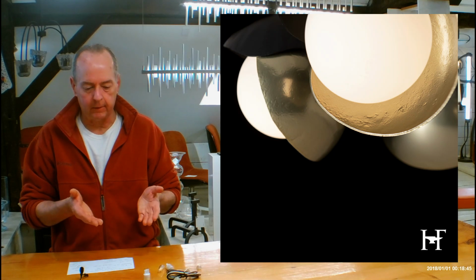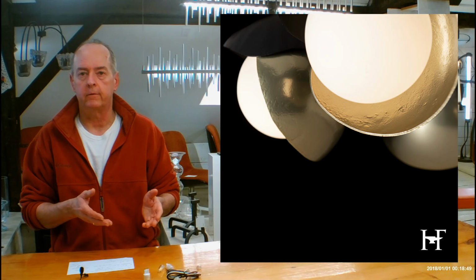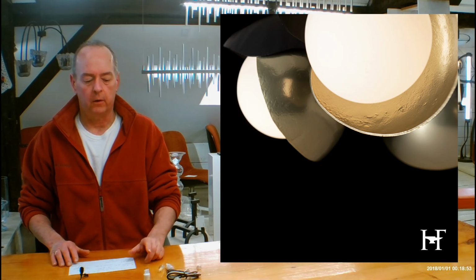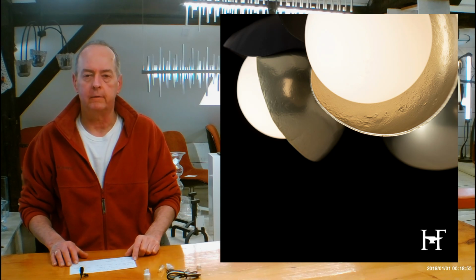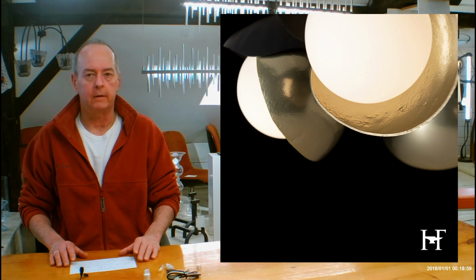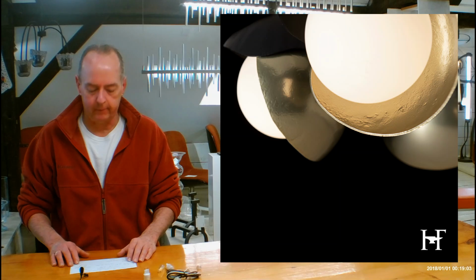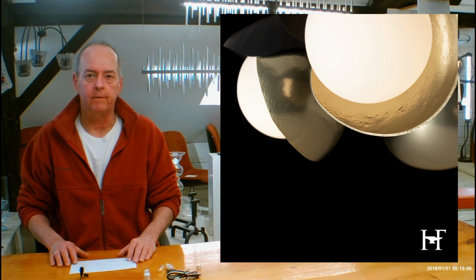The color of the light that they offer these to you is always going to vary when you're out in the marketplace looking. They're going to offer these to you in 2700 Kelvin. That's going to be a super yellow light. They're also going to offer these to you in something called daylight. And daylight sounds like a warm light, like sunlight, but it's not. That's that bluish white light, like a hospital waiting room or overcast day. That's going to be 4000, 5000 Kelvin on that Kelvin scale.